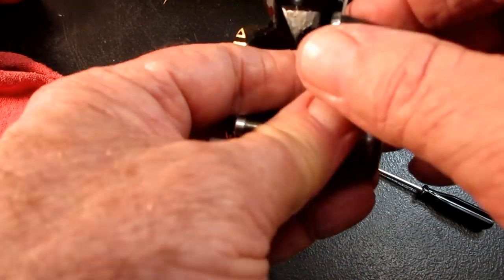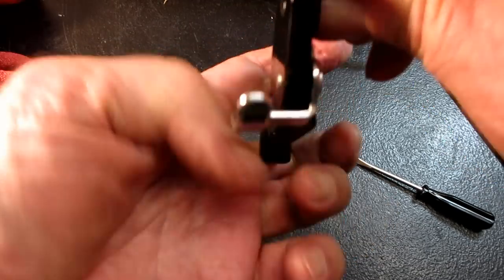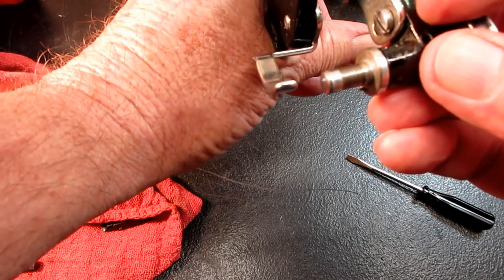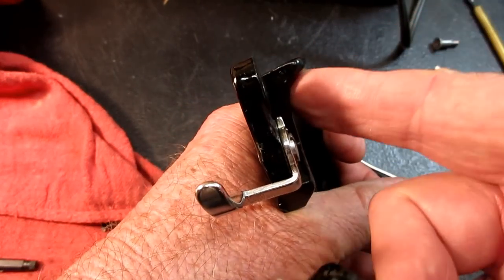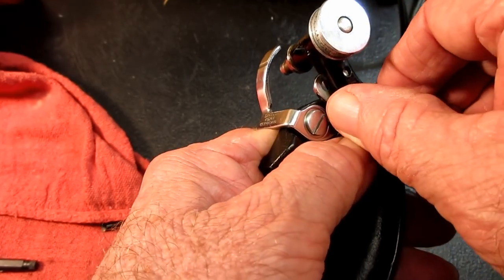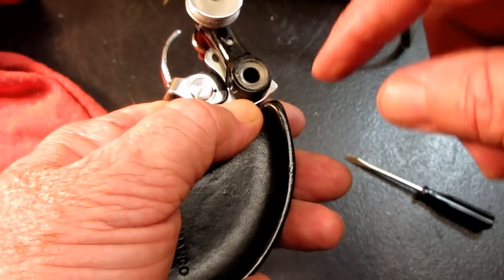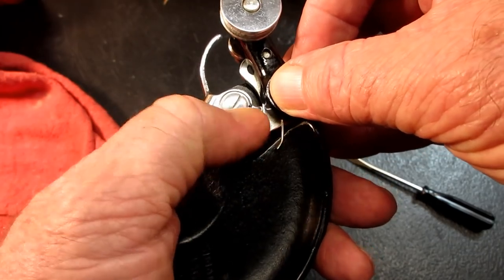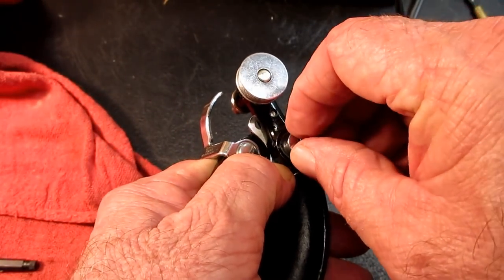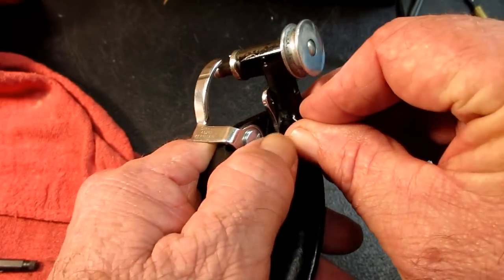So with this, I've got to put the frame back on to the belt cover bracket. And of course the bracket like that, with the latch over here on the left and the spindles on the left. But this finger of the spring has to be up under the edge here. So I've kind of found it's easier to get the swivel or hinge screw started by putting it like that, because that way I can get the spring down here and the tripping arm is down by the latch where it's going to end up working together. Now my spindle isn't under the latch yet, but I can fix that. But this seems an easier way to get that darn frame mounted back onto the bracket.